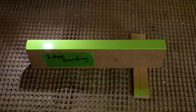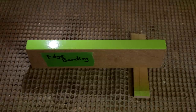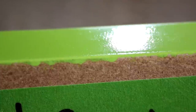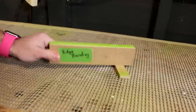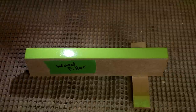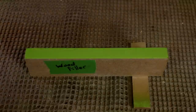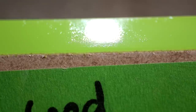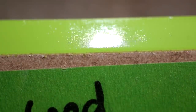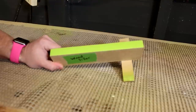The edge banding — as expected, silky smooth to the touch, really glossy surface. I'm really impressed with it. I can't see or make out any kind of pitting; it's a perfect coverage. So for this I'm really going to have to say five out of five stars — this one's brilliant. The wood filler has really impressed me too — it feels silky smooth to the touch and the surface is looking great, really glossy, but you can still see some banding. That may be where the MDF has come through from the filler itself, so perhaps I should have done a slightly thicker coating of the wood filler. I'm going to give this four out of five stars.